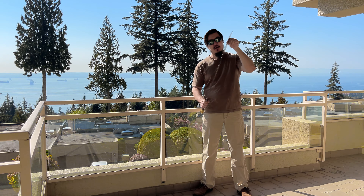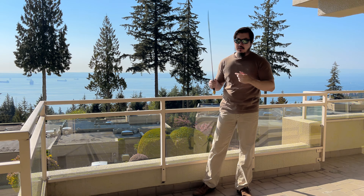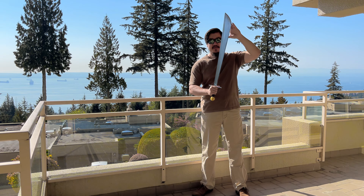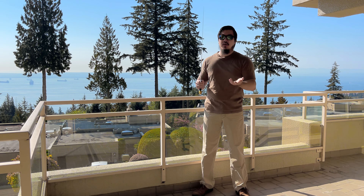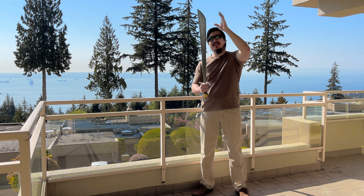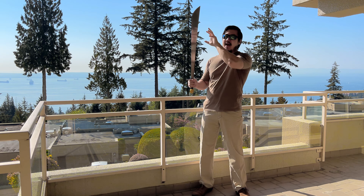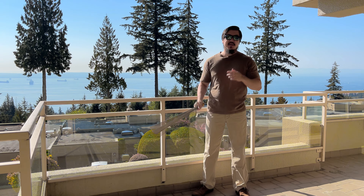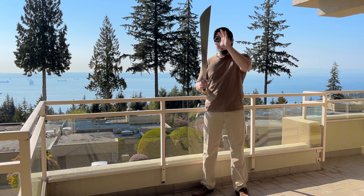That's not just related to cutting performance — it's reducing a ton of weight. If you can fuller the blade on that portion to something less than 1.5mm, you reduce 40-50% of the weight up there. That would just make the sword much nimbler, because it's so far away from the hand — 26 to 27 inches away. The further away that lump of mass is from your hand, the clumsier it gets. Just think of an axe or a club.